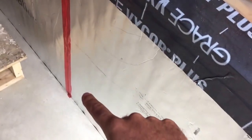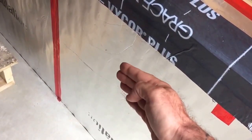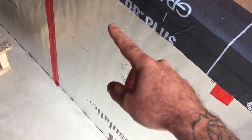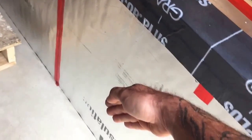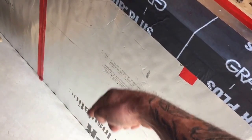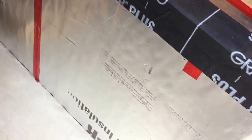We've got 4 inches of foam on the wall here. There was a 4-inch gap between the slab and the outside of the foundation, and the membrane that ran underneath the slab came up, concrete wall was taped off really tight. We took that 4-inch piece that was in there and pulled it out completely so that the Tough-R insulation could slip all the way down to the bottom of the pocket, so there's no interruption between the spacer that was in there and the foam that's going to live there. So that we don't have to tape anything here. I think it's a tighter solution.